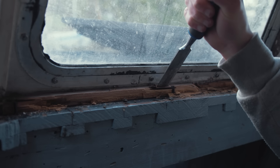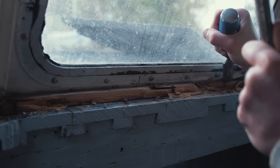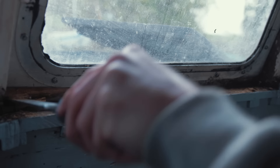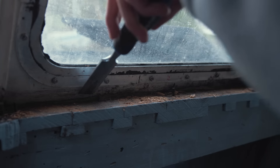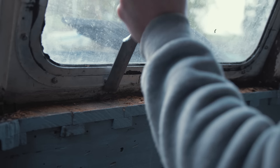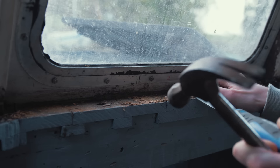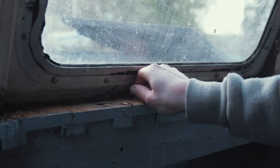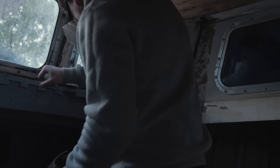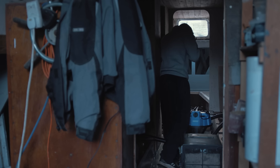I'll adapt and make a much bigger shelf, because the beam that runs underneath the ends of the deck planks directly under the windscreen has dry rot. I'm going to remove that and make it much stronger, and also bring it out further to allow a bigger shelf unit in the V-berth. It's great to see the ends of the deck planks are nice and dry — no sign of rot. The rot only affected the plank on top, which was the shelf, and didn't get down that far.